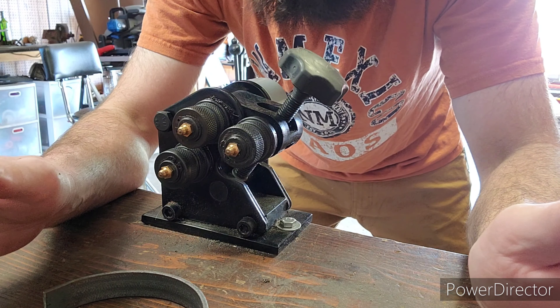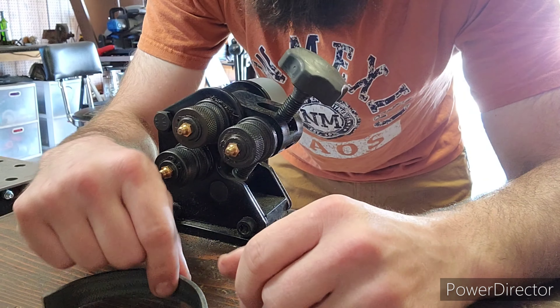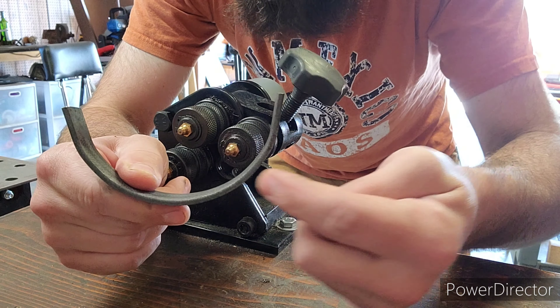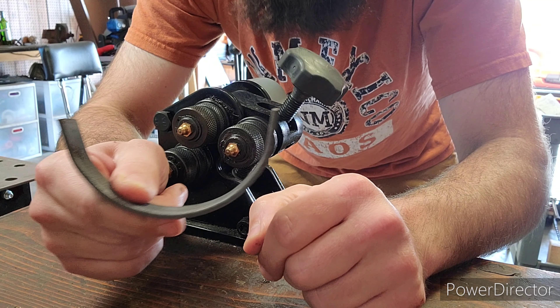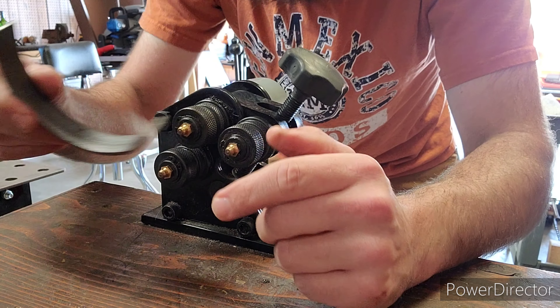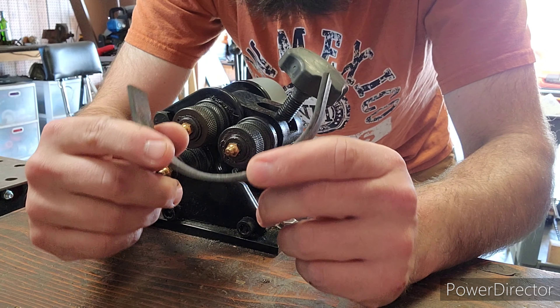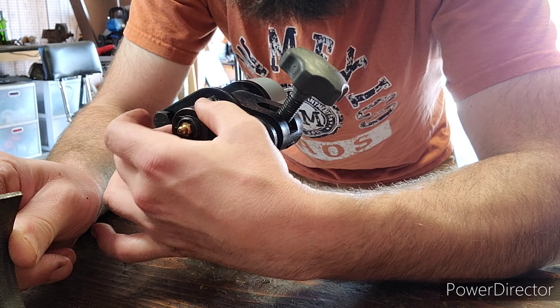This pyramid style roller has advantages and disadvantages. The biggest disadvantage is: if you look at this steel from the side, you can see how we have this nice curve and then the last bit of it is unrolled. That's the big disadvantage - there's always going to be a section of this steel that when it pops out of the roller, it is going to be unrolled.